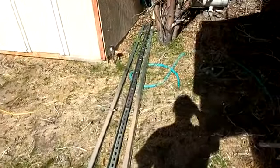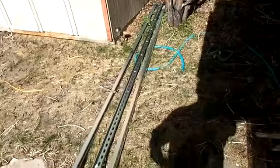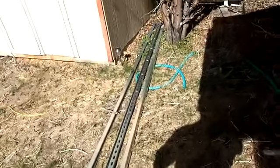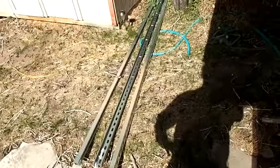Okay, I got four more pieces of steel here to cut. Three of them will be cut to 68 and 38. The remaining piece on that will be a leg. And then the fourth one will be cut to three pieces of 38. So all of that combined with what I've already cut will give me enough for 8 panels. And we have 8 panels so far.